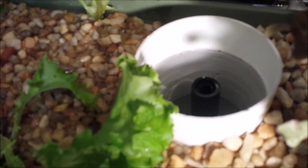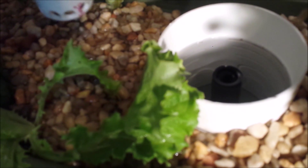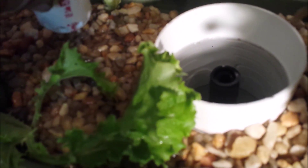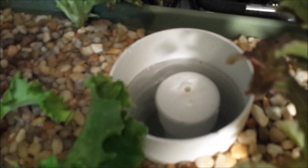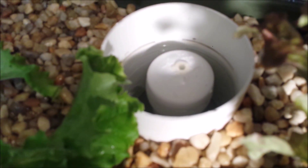As you can see, the water's filled up now and it is overflowing on the filler pipe. I did get back to the hardware store to get the 4 inch pipe, and the pipe I used is an irrigation riser pipe — designed so you can put it in the ground and cut it to the level you need, then screw your irrigation fitting on top. Let me show you how the siphon works — I'll put the tube on and it'll start siphoning probably immediately. There it goes. When it starts the siphon, there's a pipe going down into the tank and it blows bubbles way down deep. The goldfish actually seem to enjoy it — they swim out and get in the current.